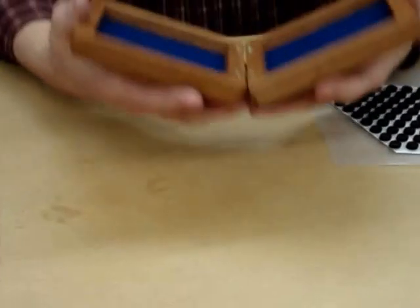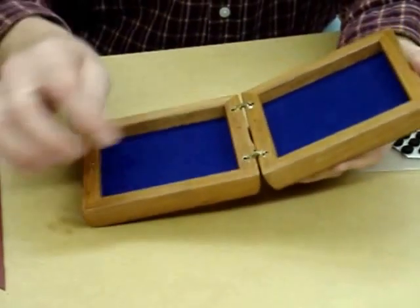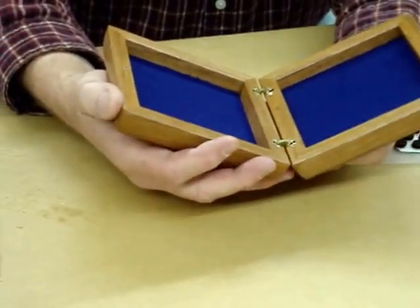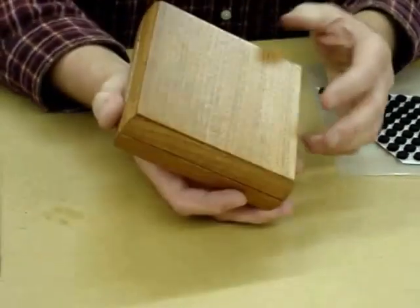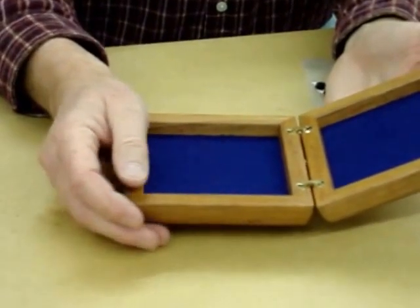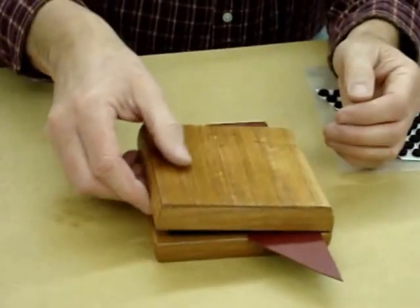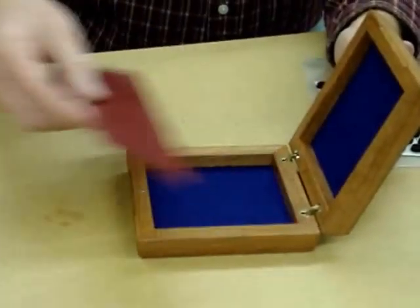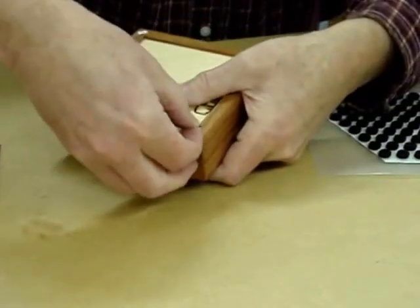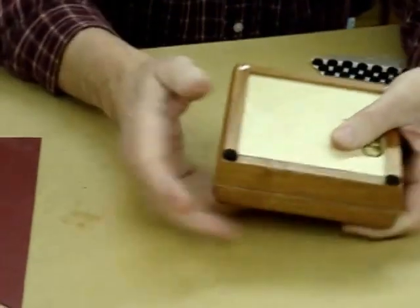I've got the hinges installed. Unfortunately, I did break a few screws. I highly suggest that after you get the hinges pressed in place, you drill a 1/16 inch hole right next to it to clean the hole out — I think that was the source of my problem. If you get any binding or the box not wanting to close completely, it's likely that you have one side of the hinges installed too deep. Take a piece of plastic laminate, put it in the box, and gently pry it out just a little — that will help your box close. All I've got left is to put the felt pads on the bottom, and this box is done. Thanks for watching, and I appreciate any comments you might have.